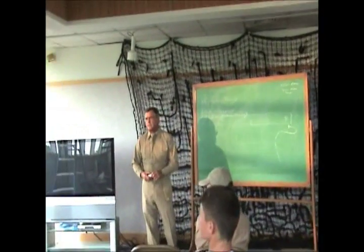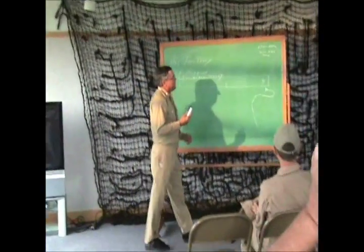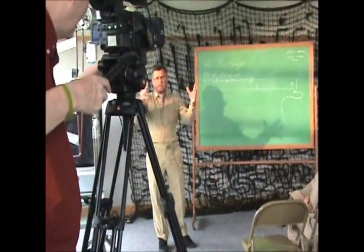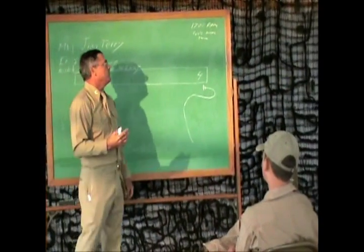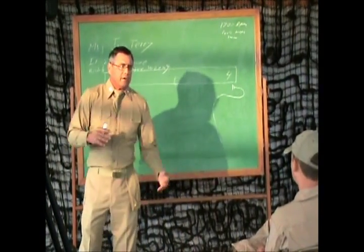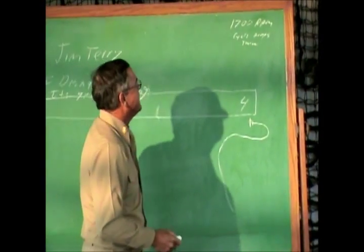So we make sure when you stop you can brake. Sort of. Okay. When we cycle the props, the domes are these huge chrome things on front of the blades. They hold about a gallon of oil. The oil is cold. It doesn't circulate. So by this point, the engines are warm, and we need to put warm oil in the domes. So we accomplish two things. We cycle the props, which limbers them up, and we get warm oil up inside the domes. So we get the old oil out, put the warm oil in.